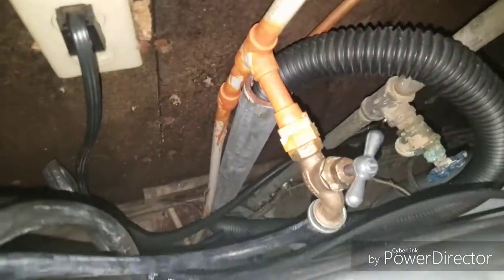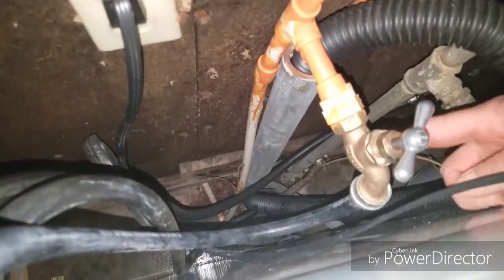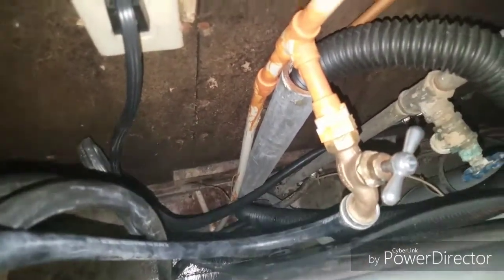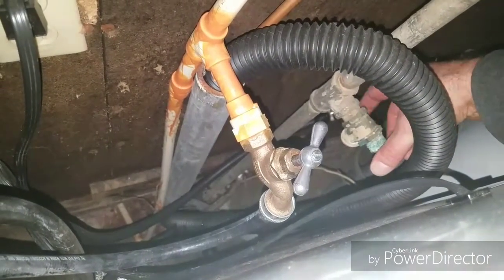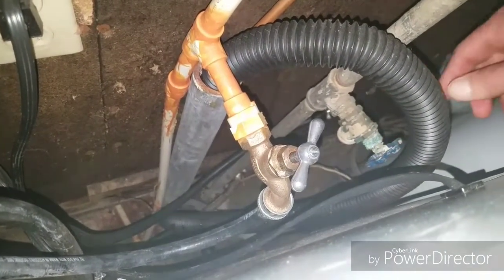And this is what I was talking about. I've got the hose hooked up at the drain of the hot water tank, open that little valve, and it's blowing it right out. I've still got my air hooked up on the hot water side. This is the cold water side. I hooked the hose from here, and I turned this valve off. Made sure to cut that valve off.